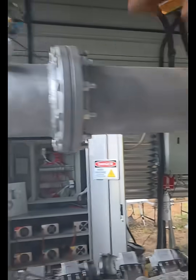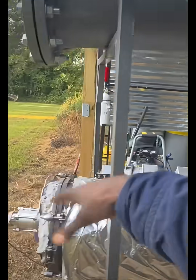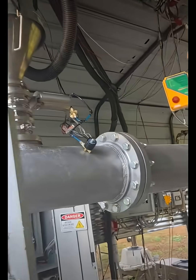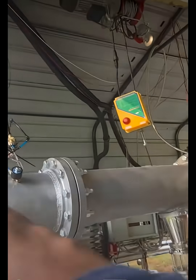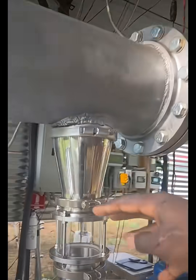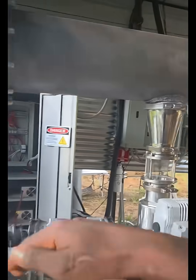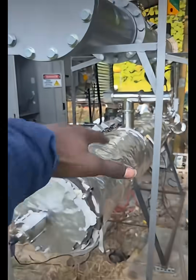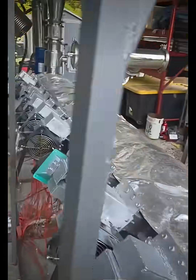I have a valve that isolates both of these chambers when the machine is on and under vacuum. I'll be able to load plastic into this chamber, close off all the valves, pull a vacuum on this chamber, and then open the valve to the main reactor so the pressure is equal between both of them. So what happens to the plastic once it's in the main chamber?